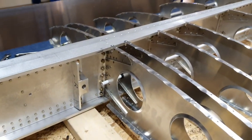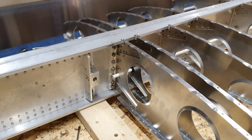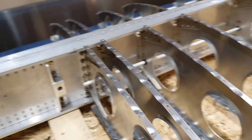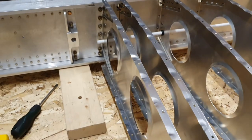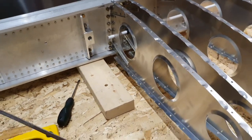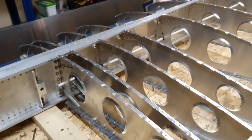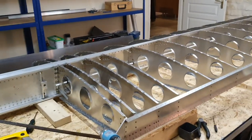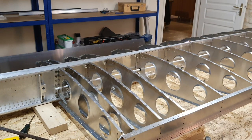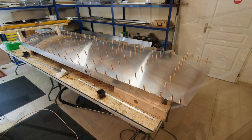I'm not really sure yet how we're going to get the cable into the aircraft at the root end. Once we've built up that bit of the fuselage we should be able to see what to do — if necessary I can always chop it off before the root rib and come in through one of the other holes, or drill an extra one. So: wing box section riveted and electrical conduit for the wires fitted. Next is to reattach the upper aft wing skin.